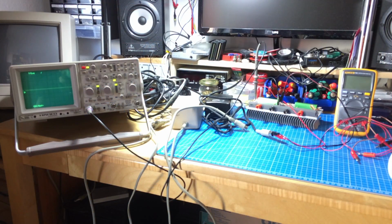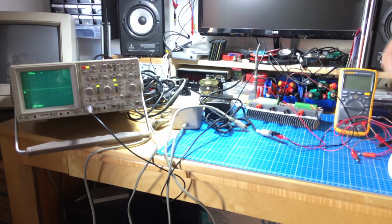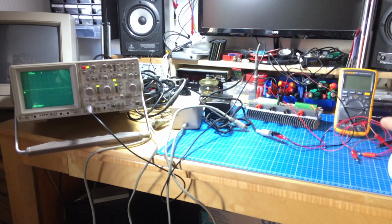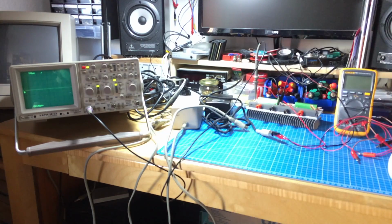I brought out the scope. What I'm trying to do is to make a very crude measurement of the ripple and the noise of the power supplies and compare them maybe. So here's my setup. It's under load. This is for the 5 volts. The other load is behind there at the moment, so I will connect it basically like when I measured the voltage, the same way, and then connect the scope probe over there and see what we get.